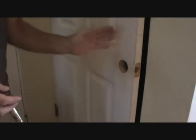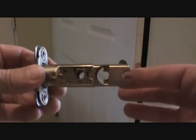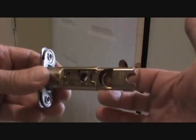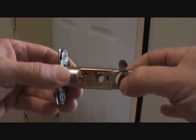And why does it matter? Well, when you get your door handle, make sure that you get the associated knob that you need, either a 2 3/8 back set or 2 3/4 back set. Years ago, you had to look, and they specifically made them either way at the store. Now, most of the time they do a universal one. This is how this one looks. It's going to fit in that middle one.